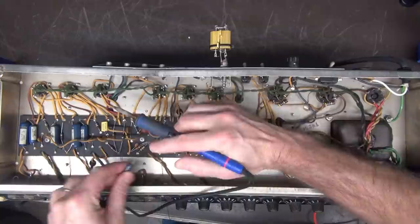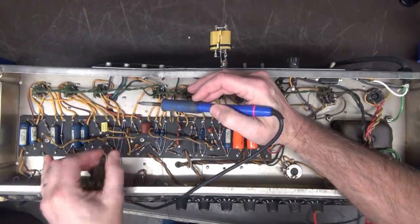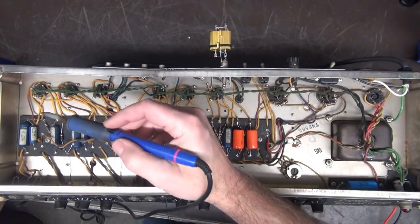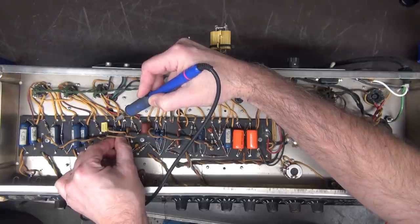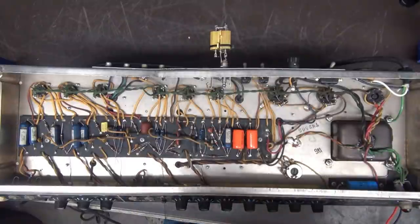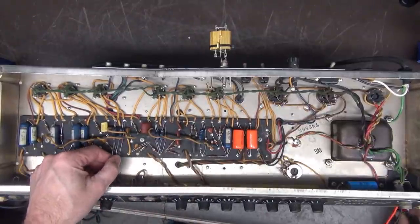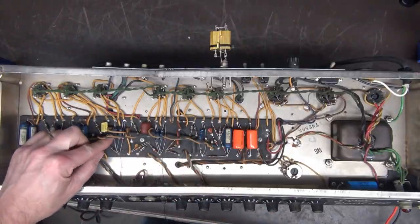Well, we just started using auto range multimeters, and I was watching this guy working. Of course, I'm not allowed to say anything. I just get to sit there and watch. And he was working on this piece of equipment, let's just say, and he was looking for 200 volts DC. Well, he hooked up to the test points, but he didn't realize that he had never turned the piece of equipment on. So he was going through the checkout, and the auto range meter auto ranged, right? It went down into the millivolt scale because there's no voltage there, and he didn't realize that, right? So by chance, it came up on the meter display 200 millivolts. Just happened to be some residual voltage hanging out there, right? Well, he thought it was 200 volts.